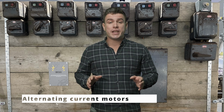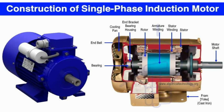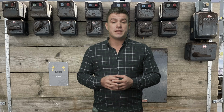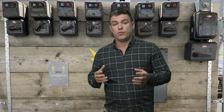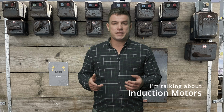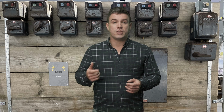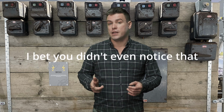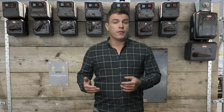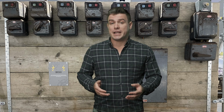They use a switching AC current across two magnets, or one magnet and a magnetic field. With different polarities, the current provided to the pole induces an opposing magnetic field, causing either the inner or the outer to rotate. Since the UK power grid is 50 Hz, this means that the magnetic field of an AC motor changes 100 times a second, which results in a set speed for induction motors depending on the number of poles. So the speed of this type of motor is governed by the frequency of the switching magnetic field and the number of magnetic fields.